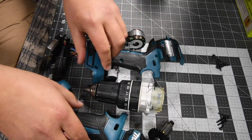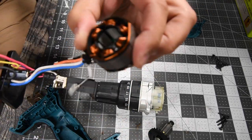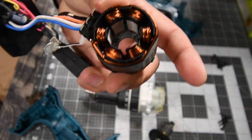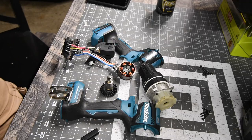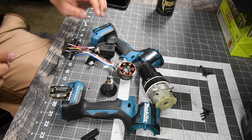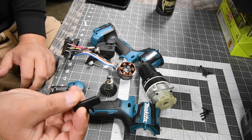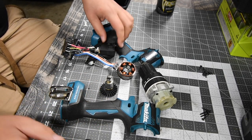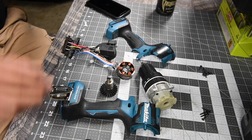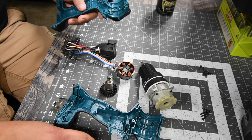This is all that a drill is. Everything is clean and dry. It looks much better. The motor is now 100% free of debris, which is good. Let's put this back together. Reassembling is absolutely simple. The only two things you need to make sure of when you reassemble a tool: put the forward and reverse back on properly, and speed one and speed two on properly. Everything else pretty much just goes into the clamshell and it's self-explanatory.